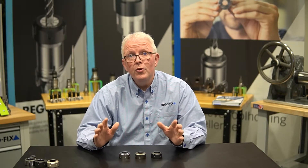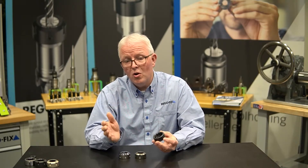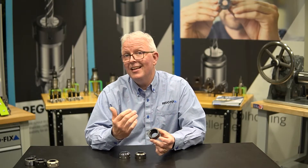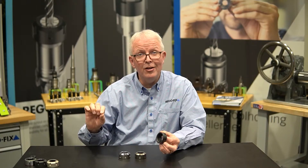There are a wide variety of different ER nuts available. The good thing for you, the end user, is you can look for the same type of wear regardless of whose nut you're using. We talked about damage on the outside by deforming the different pockets used for the spanner wrench, but what about the part of the nut that actually does all the work? That's the inside. To determine whether the nut you're using is worn, suitable for use, or something you need to replace in the near future, take a look at the inside.